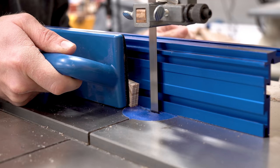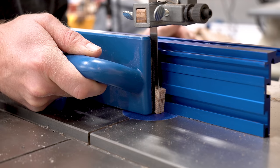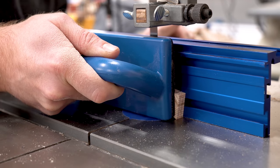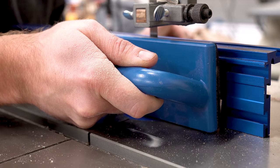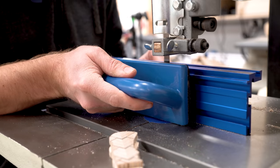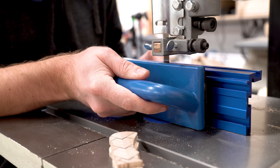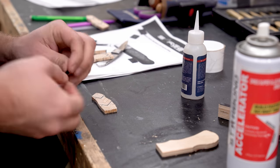So it was interesting, I kind of had to repeat this process several times, making both the handle for the axe and the handle for the knife. What I realized here was that the easiest way to get the pattern to match on both sides is to resaw it. And I probably should have glued up a taller panel for the hatchet handle to make sure that it matched up, but you know, hindsight's 20/20.